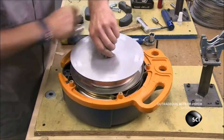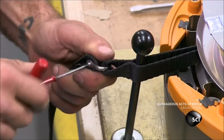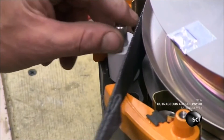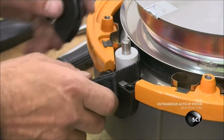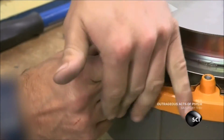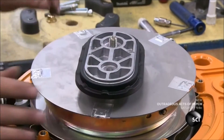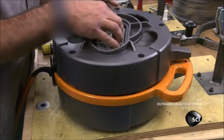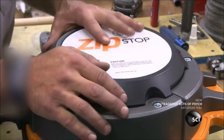Using a crank, he winds more of the webbing into the brake. He tightens the metal shackle that holds the two sections of webbing together and winds the rest of it into the device. He inserts a guide roller for the webbing and adds a two-part retaining clip, securing it with a rounded metal pin. He then screws a nut onto the shaft to lock down the plastic insert for the top of the case, places the top half of the case onto the brake assembly, secures it to the lower half, and snaps a dust cover onto the case.